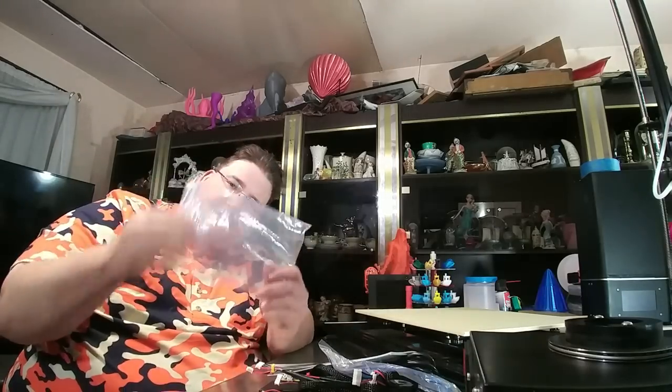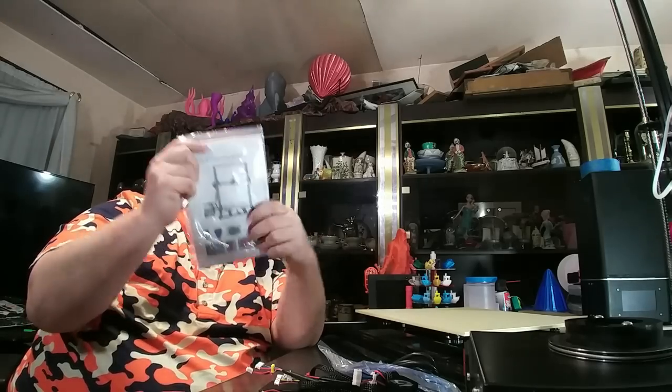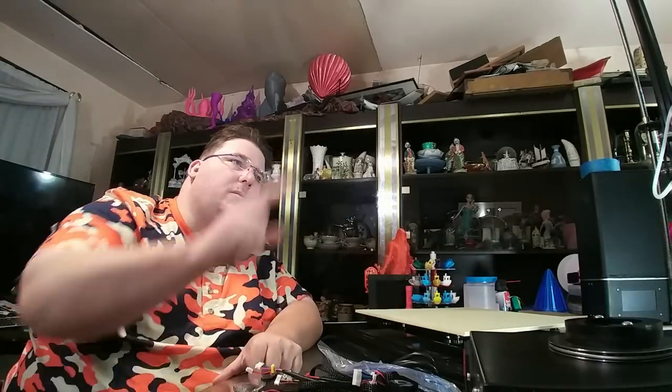Overall a good goodie bag. I'd like to see them put an AlphaWise contents label on the bag and make the bag larger — it won't fit the instruction manual. Use one size larger bag so you can store the manual and extras together. They should mark it with the printer name. Next step: assembling the gantry, placing it on top of the printer and putting four screws through the 2040 bottom rails into the 2040 vertical rails.